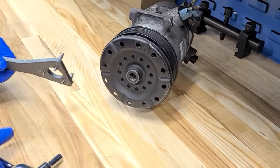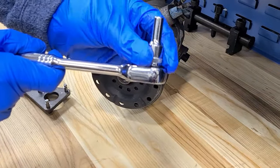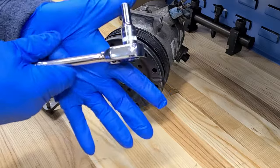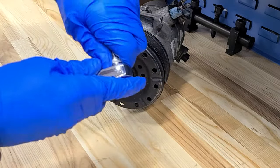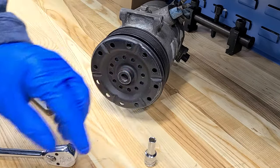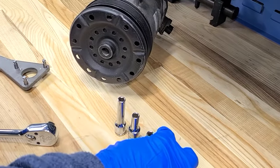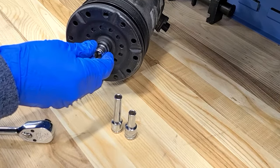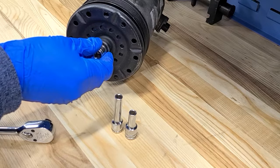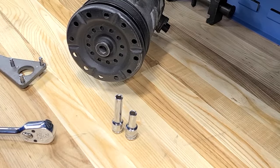These small pins, you don't need that. I'm also going to use a 7mm 6-point socket, 3/8 drive. You really do need a 3/8 drive because there is way too much torque for a quarter inch drive. I'm going to use a mid-length socket — a deep socket will also work, but a short socket will not work. Most brands engage with the hex on the shaft maybe a millimeter or two, and you're just going to strip it because that is a soft shaft.